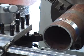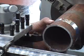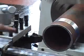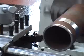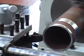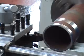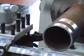I'll take a cut from the front to see if it carries through — I'm hoping it doesn't move on me. What I'm hoping to do is set this up so I can face it as a safe operation. You run a big risk any time a piece is extended out. The rule is always to hold it out as little as possible, but the machine's spindle hole isn't big enough to accept the full diameter of the pipe, so this is a compromise.